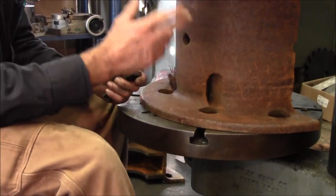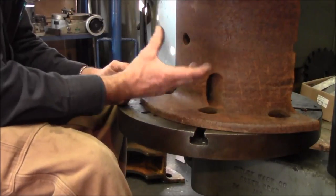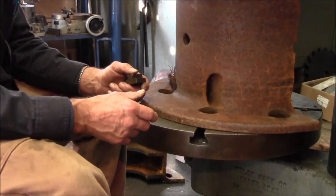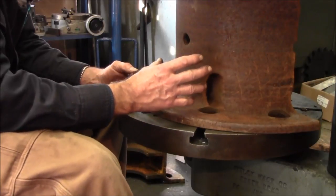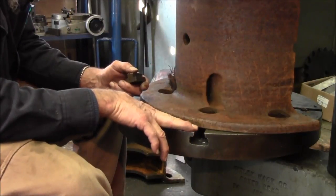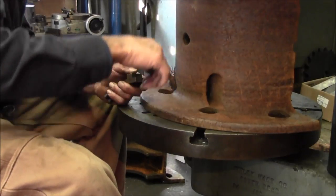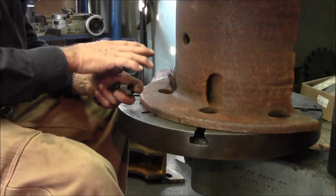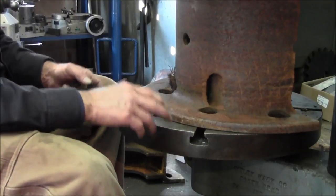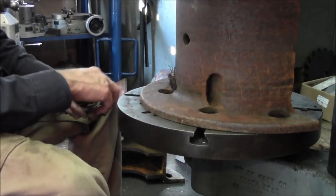And what this is, is a faceplate off of a lathe, so I took a slug to resemble the straight shank portion that goes down into this lower section of the knee, and threaded it for the spindle threads that this was originally designed to spin on the lathe. After I mounted the two together, I took set screws and locked the two threads together. Loctite set screws drilled on the split line and everything else. It's never coming off of there. Anyhow, that's how I got this table on here, and I have the T-nut slots.